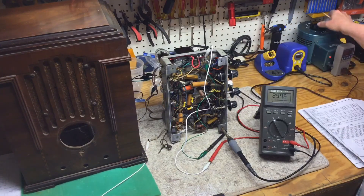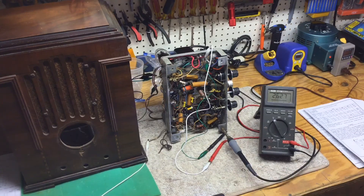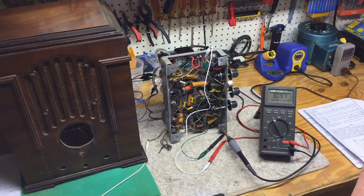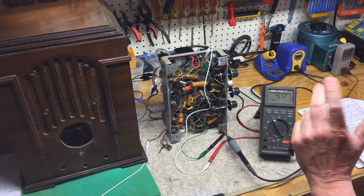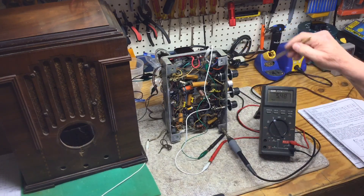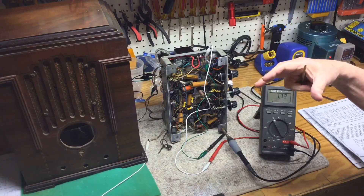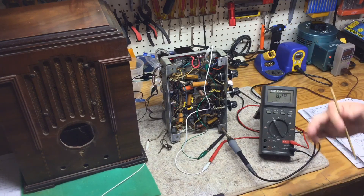I'm going to shut things down here. I don't want to take any chances of doing any damage or have a capacitor short out and create any new issues. So hey, thanks for stopping by and checking out this Zenith 808 first fire-up. We saw it together — pretty cool. No smoke, no fire, and the DC voltage and AC current seem to be steady. I think we're pretty good to go. I'll start replacing these caps and I'll probably do one finale video that shows the steps I took as well as doing the RF alignment. I did have a question since I removed the three pieces of mica off the tuning condenser when I was doing the cleaning — where do you know how to torque those three screws or adjustments back down? I'll cover that in some photos or a future video on the RF alignment itself.